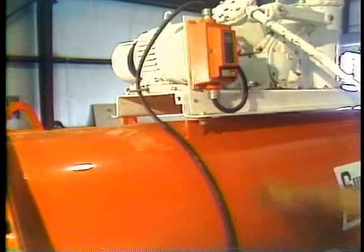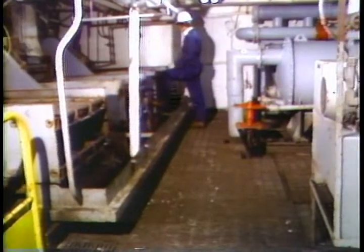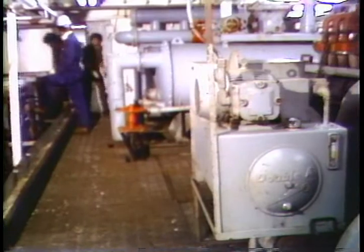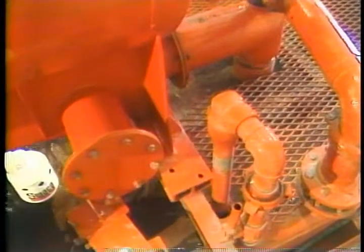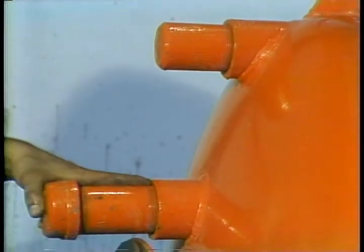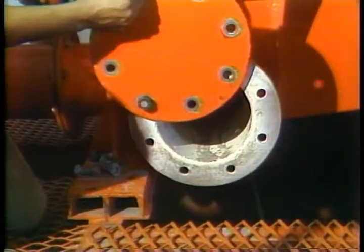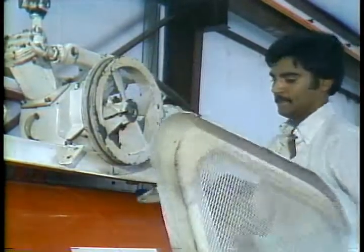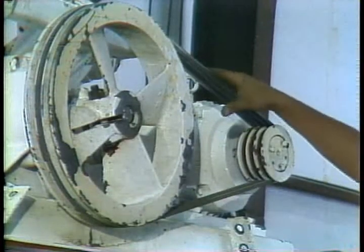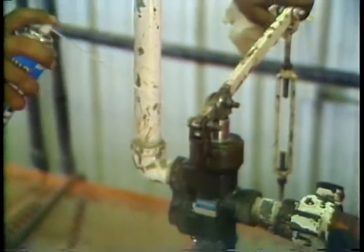When shutting down the degasser, simply stop the vacuum pump and shut off the auxiliary pump which powers the jet nozzle. If you're not going to use the degasser for a few days, you need to flush it thoroughly with fresh water to avoid any buildup of solids inside. To do this, operate the jet at normal pressure with the vacuum pump off, and flush the degasser with clean mud through the two-inch wash line for at least two minutes. Then close the two-inch ports, remove the six-inch ports, and wash the inside of the degasser thoroughly with water. Every so often, take the belt guard off the motor and check the belts for wear — there should be about half an inch of play in the belts. Get some WD-40 or liquid wrench and spray the three-way valve clean so that it has freedom of movement.